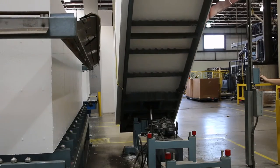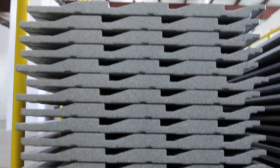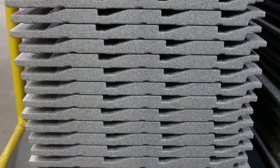We really wanted to figure that out, and in earnest in 1992 we started bonding in a very simple, rudimentary fashion. We would cut foam into contoured shapes that match the back of any vinyl siding panel. In this plant, we probably make now today around 3,000 different shapes of foam to line up with 3,000 different kinds of vinyl siding.